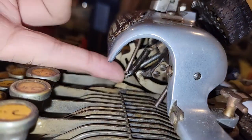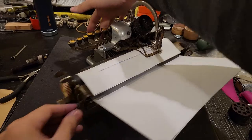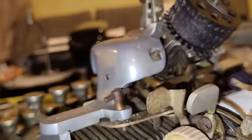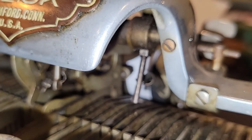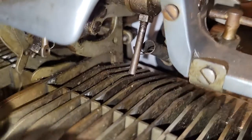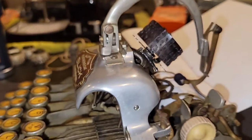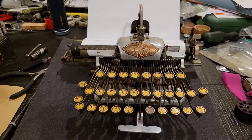In my case, to make this particular machine feel lighter, I had to push this in. Then for this particular part, I had to go and loosen a screw that should be situated over here, that screw. And maybe not exactly necessarily that nut. Now, of course, it was probably all seized and rusted, but with enough force, I was able to push this in and reduce the tension of the spring so that it actually starts completely unstretched for a bit, and then starts moving while still being strong enough to lift and reset this mechanism fast enough. Okay, so now let's type.